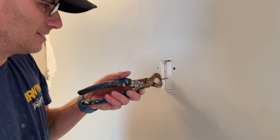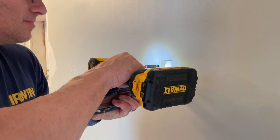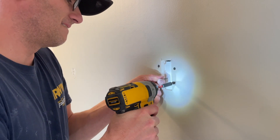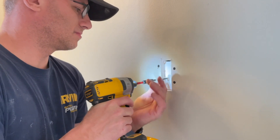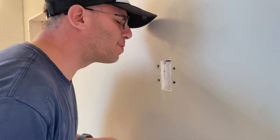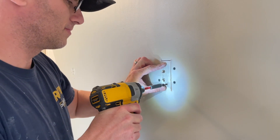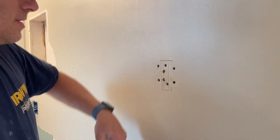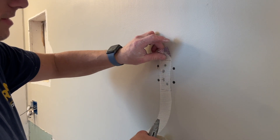I have my tile snips here. This makes it way easier — I can pull like so and then add another screw, then add two more screws. Next step, we're going to add back this piece of half-inch drywall. Make sure it's clean, blow it all out, and then add just two drywall screws. Next, we'll push that in a little bit, hit it with some joint compound, and get some mesh tape — it should be wide enough to cover.